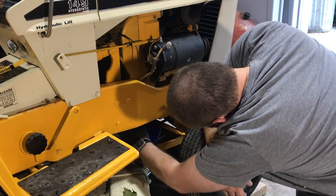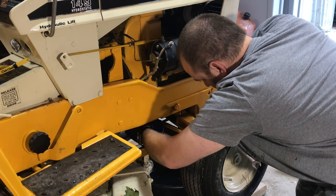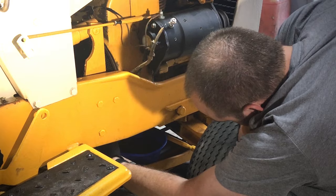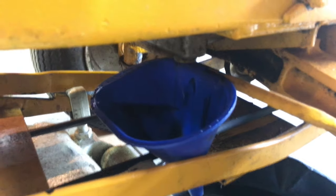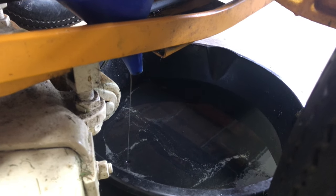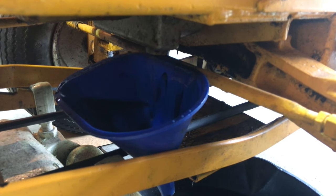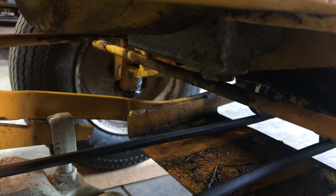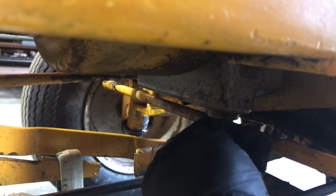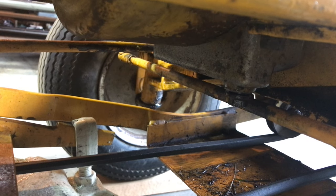Make sure that my funnel is lined up. You can see how my system is working — the oil is draining out of the drain, down through the funnel, and into my catch pan. No mess, nice and clean. We'll let that drip out and then we'll put the plug back in. Pulled the funnel out. Now just snug it with the wrench — not over-tighten, just snug.